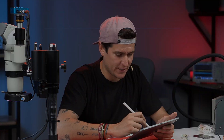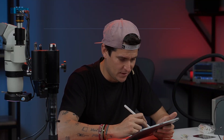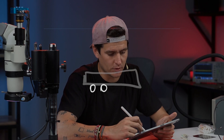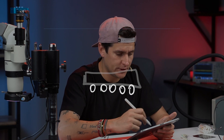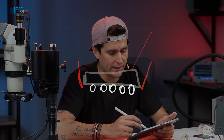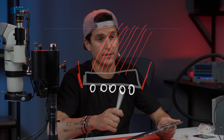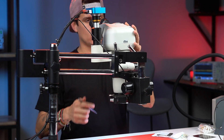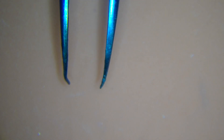We have a circuit right here — these are the solder balls. We're going to put our tweezers here and apply heat on the top of the circuit, but in this method we have to lift the motherboard a little bit. Let me show you my tweezers — I bent the tip a little bit to create something like a hug shape.